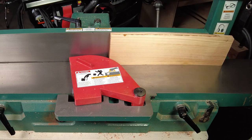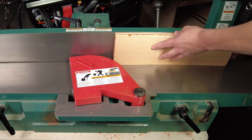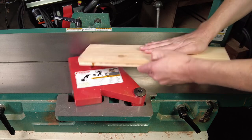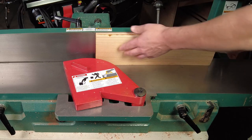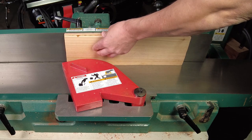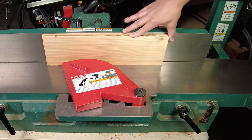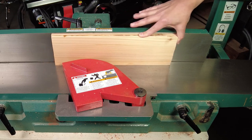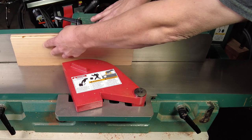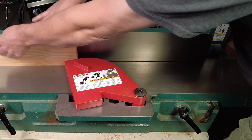One theory is that I was edge-jointing a piece just like this — about five inches wide. Ordinarily when I'm edge-jointing, I've got my left hand here, my fingers pushing against the fence because I've already got one flat face from having face-jointed already, and then I've got my thumbs here. I've got my eyes on my fingers and I know where they are, and normally there's a cutter guard there. In the past, I've held the trailing end with my thumb as a catch on the end and my index finger here, going over the cutter head and then transferring pressure to the outfeed side — because that's proper technique — so my fingers are safe as I go all the way across.